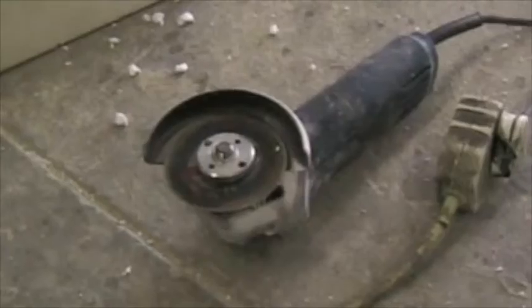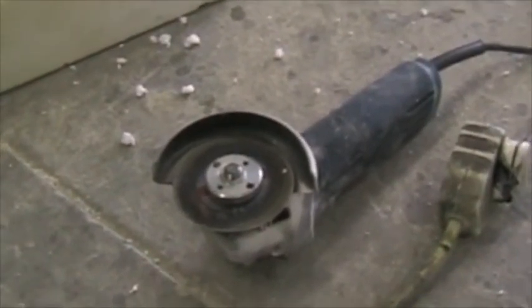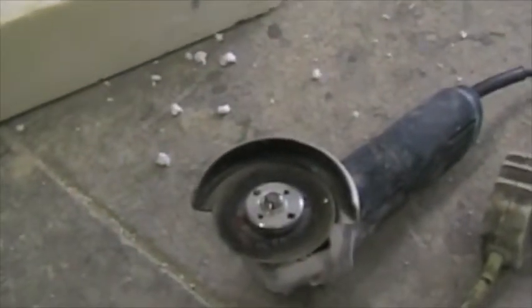I've now cut out the ailerons. I carefully marked out the ailerons on the wing from the dimensions in the manual, and using that 1 millimeter angle grinder disc, I cut out the aileron and used a hacksaw blade to cut through the foam. I cut into the glass about 3 or 4 millimeters with the grinding disc and then cut through with a hacksaw blade. The dimensions are on page W36 and W16.2.